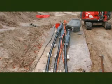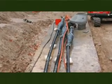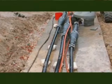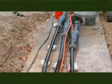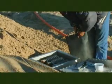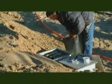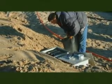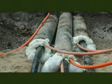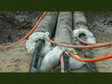The joint bays are left open until the joints have been fitted. This means that any pumps must be kept running for a long period of time. After the joints have been fitted, the joint bays can be covered. However, where link boxes are involved, access must still be allowed. When the entire system is finished and the final sheath tests have been performed, the link boxes are buried next to the joints. Following the laying of the cables, all casing pipes along the section are filled with bentonite.